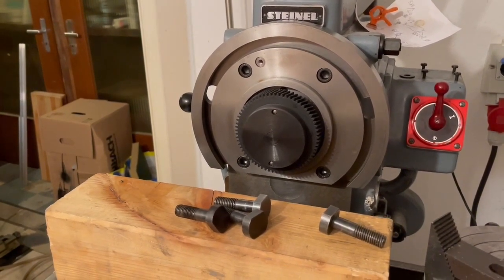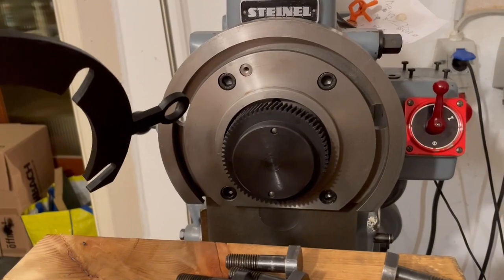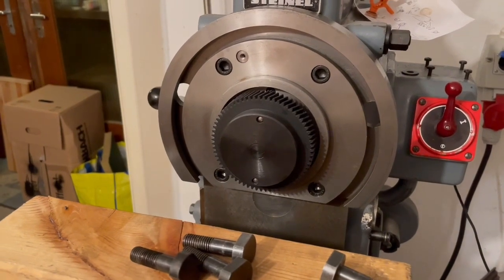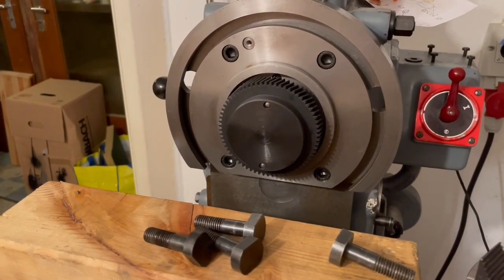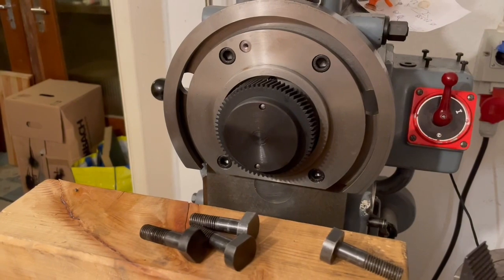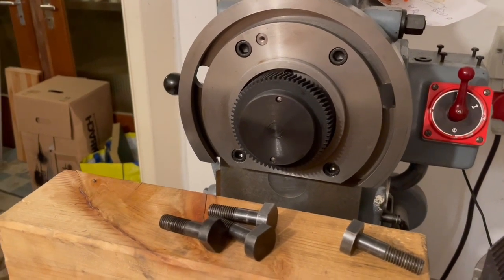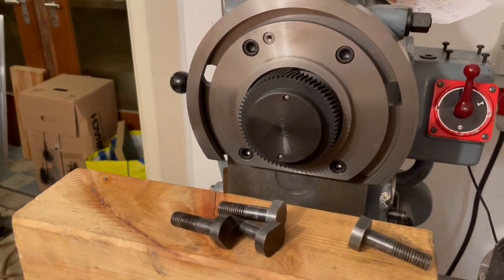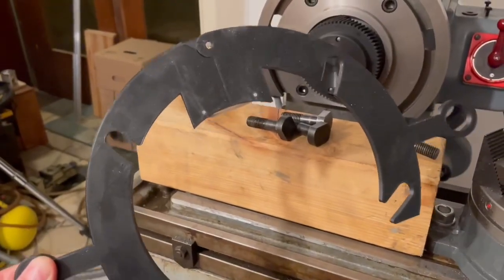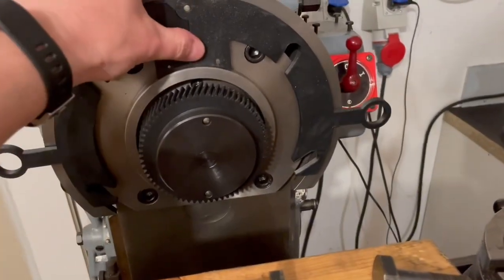What I did previously was just mount the head and then fit the screws through these slots by tilting the head back and forth, which is not held in place by any screws. That's a little dangerous because it's so heavy and I don't want it dropping on my table. So I asked myself, what can I do to position the screws already at the right point in this T-slot so that I can just slide the head on using the table? And what I came up with is this holding jig that I printed.